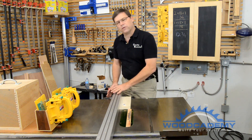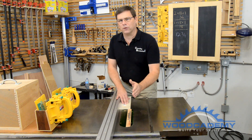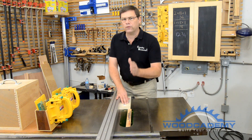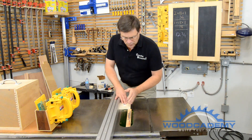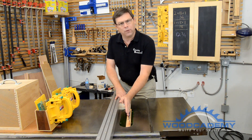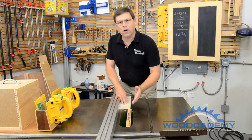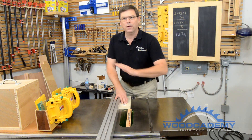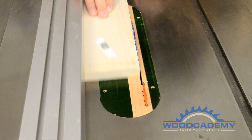The arbor shims aren't just about the rip fence scale. If you have a riving knife on your saw, or like me you use a set of splitters, those typically should be adjusted with every blade change. But with the arbor shim system, my blade is always located on the right-hand side in the same plane, so once I know the proper setup for my splitters or riving knife, I never have to change it again and I always get exactly the fit I need.